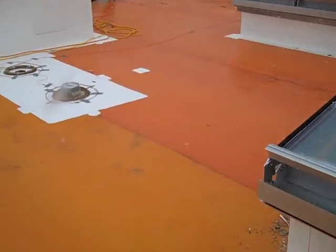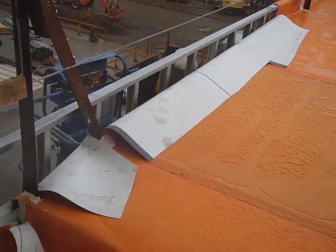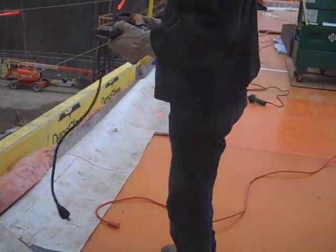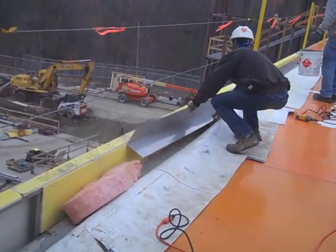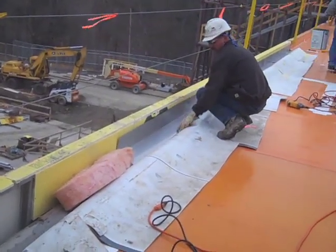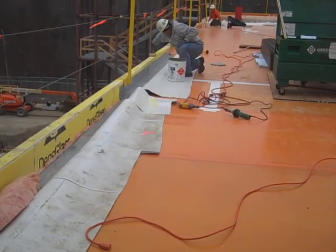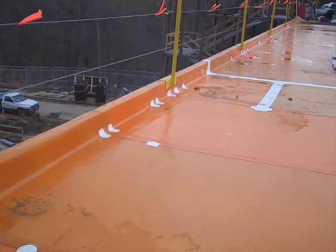As mentioned earlier, the metal stud fascia that supports stone veneer panels is covered with exterior gypsum sheathing on both the outside and inside surfaces. Then bent sheet metal strips are fastened under the roofing and up onto the vertical sheathing. The roofing is then adhered to this surface, completely covering what now appears as a low parapet wall.